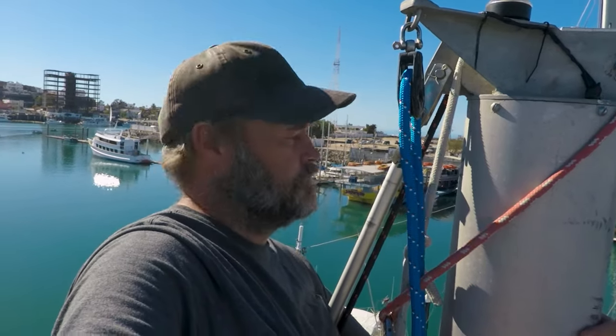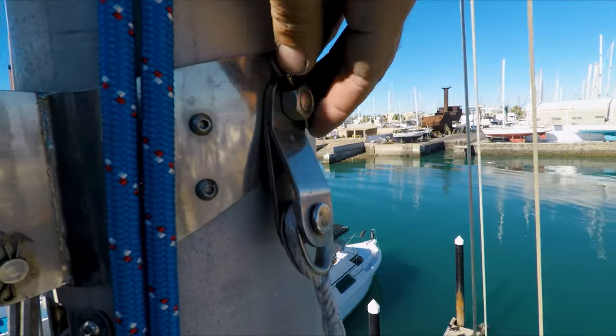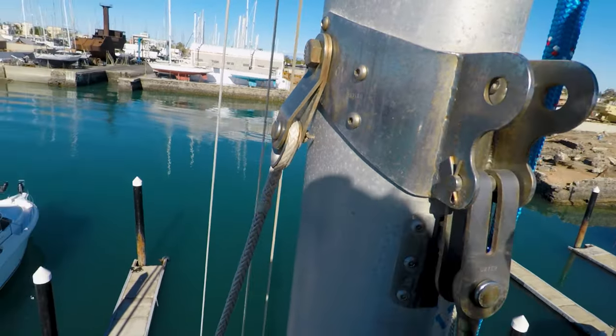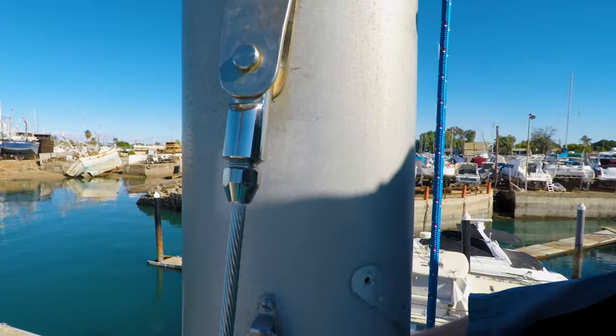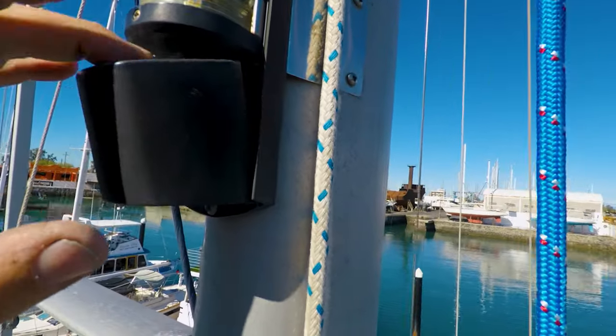Got the backstay on at the top — going to have Jessica lower me back down. It's a pleasant day, though that little fishing boat just came in and now I'm rocking and rolling up here. It doesn't take much down there to get me moving. I think it's a pretty good idea to climb your mast every now and then to check things out. As I'm coming up and down four or five times, I'm checking all the cotter pins, looking for cracks, making sure everything's pulling straight. We did find one bad cotter pin — pulled it out and it basically disintegrated in my hand. So I was pretty glad we caught that. One little cotter pin, and the whole mast could have fallen.